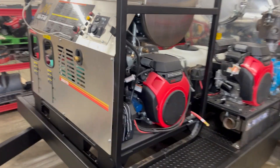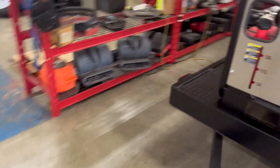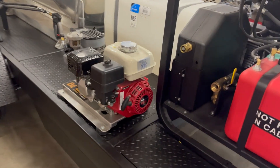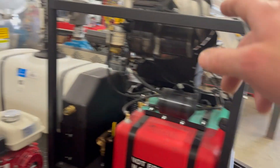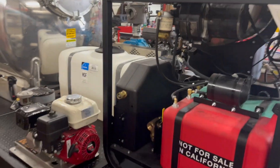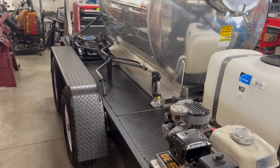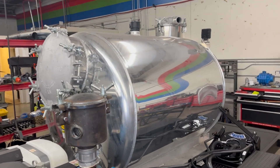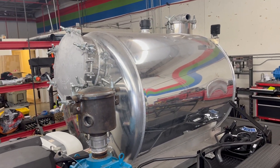This pressure washer water tank is here, and we're going to incorporate a soft wash system on this thing — a little Comet P40. The bleach mixing manifold will be somewhere in this area. We've got surface cleaner mounts on the sides, a 50-gallon tank acting as a buffer water tank, and a 520-gallon lightweight aluminum vacuum recovery tank.